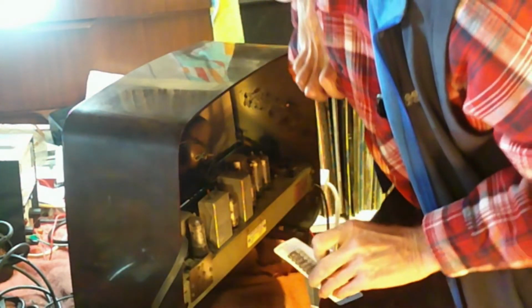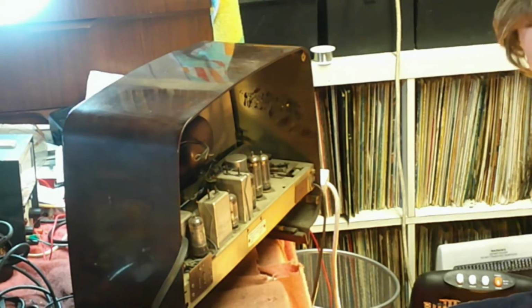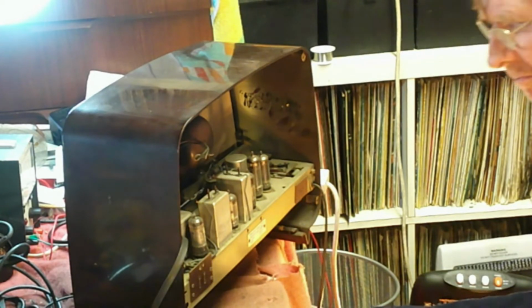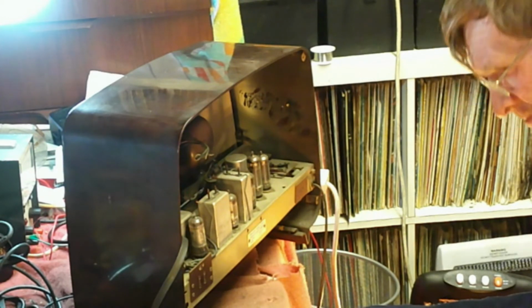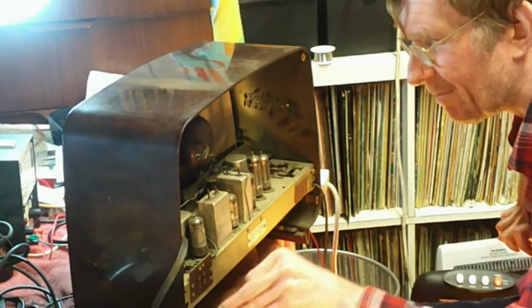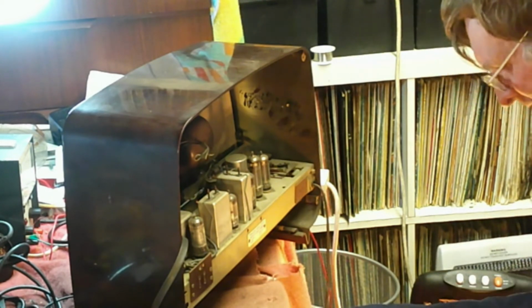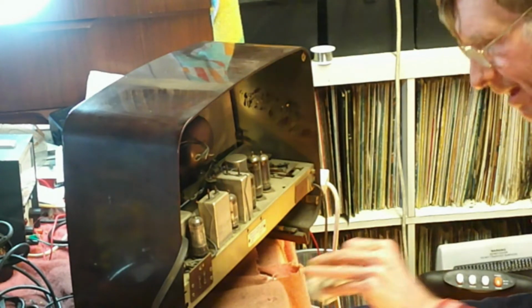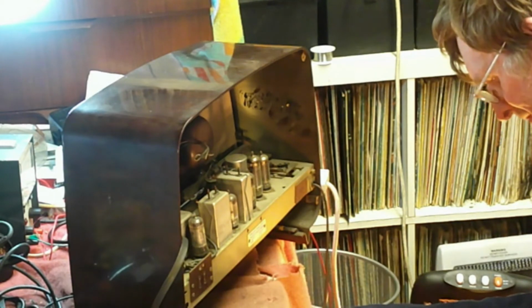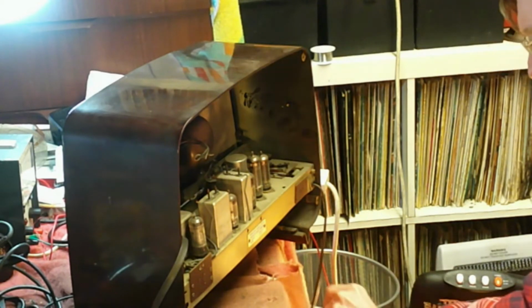It's a 13 amp. I know it should be 3, but for testing, I do like to put a 13 in, because I always keep my hand on the plug to pull it if anything happens. And the smoke that can generate can usually point me in the right direction as regards the fault, so for me it's worth doing. I will change it back to a three, I promise. I promise I will, Governor.